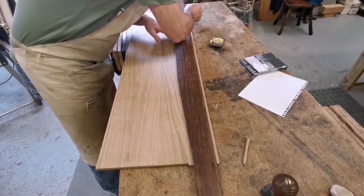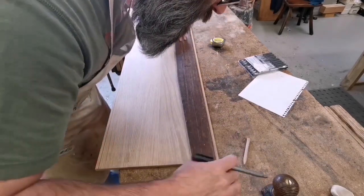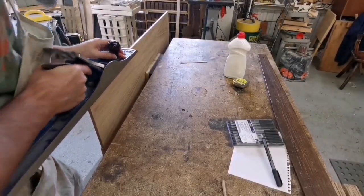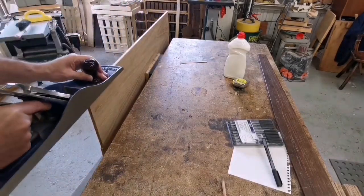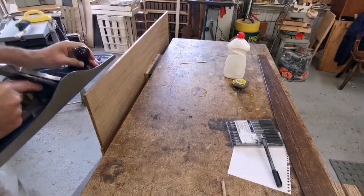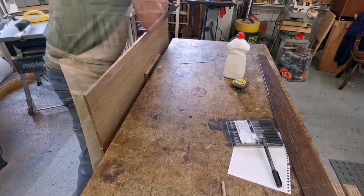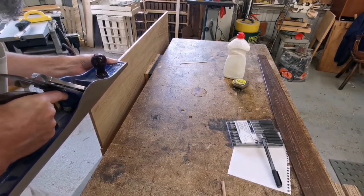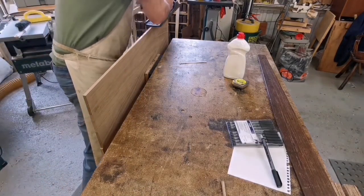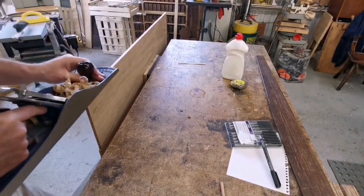Then we get on with marking the back panel. I'm straightening this edge, marking it up, and I've got to plane the panel down to that. This is the bit that I love but hate — the first part of planing a sawn plank. It always makes this ribbly, wobbly, horrible noise because it's just skipping over the high spots. It's always horrible at first, but then once you start taking smoother cuts and nicer shavings and getting results, it all improves.